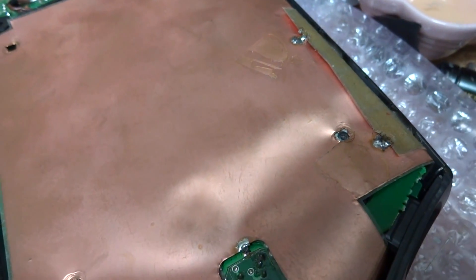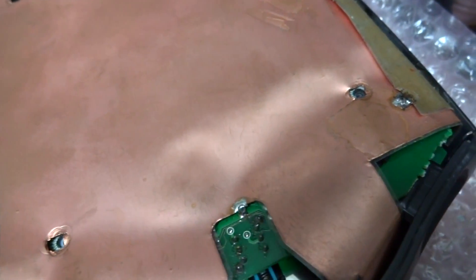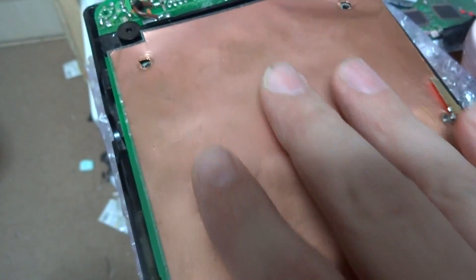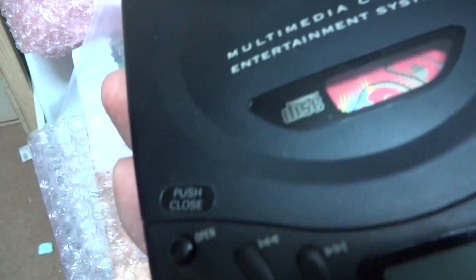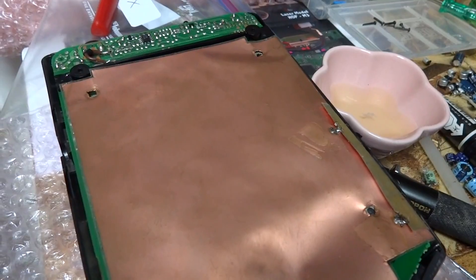What I wound up doing is standing that capacitor straight up on end — it made a good connection and didn't ground out. Just as a precaution I put a small piece of electrical tape on the top of it, and it's fitting in there okay. There's some solder underneath this one which holds it in place pretty well. The grounding shielding is all back and re-tacked. We'll put the bottom on and try and test it — I'm not too sure about that display, but we'll see.